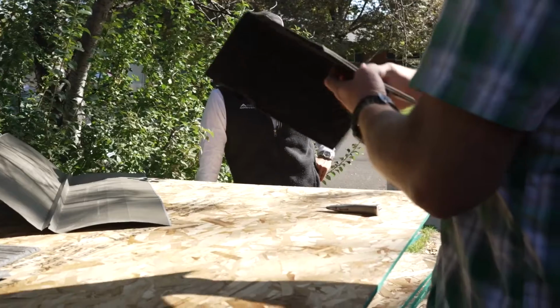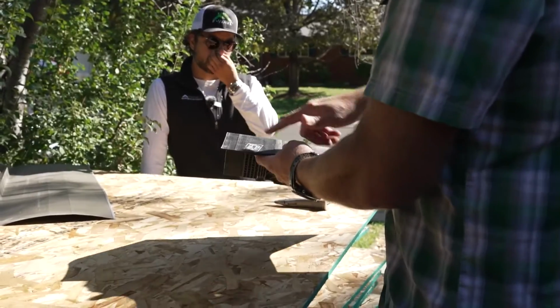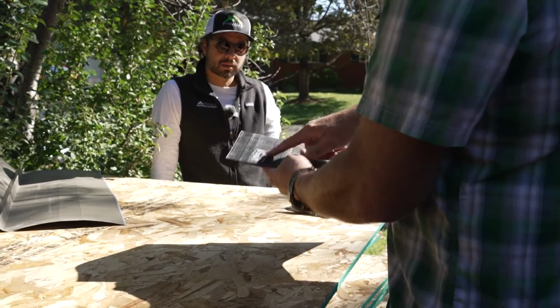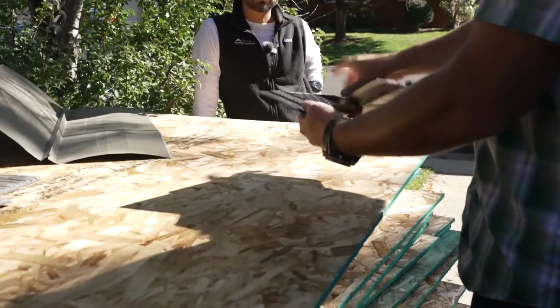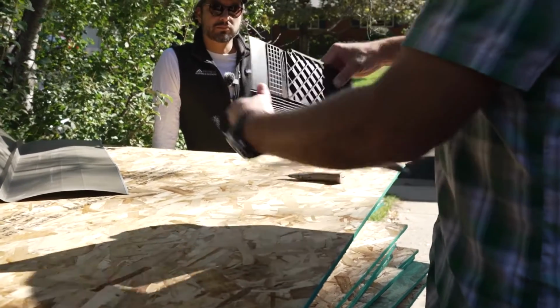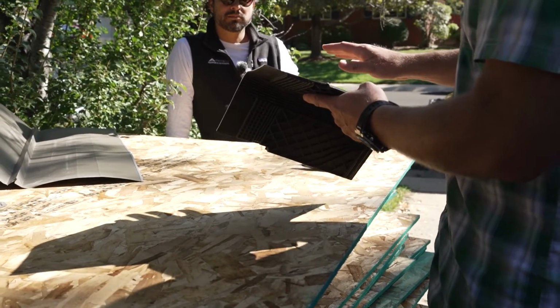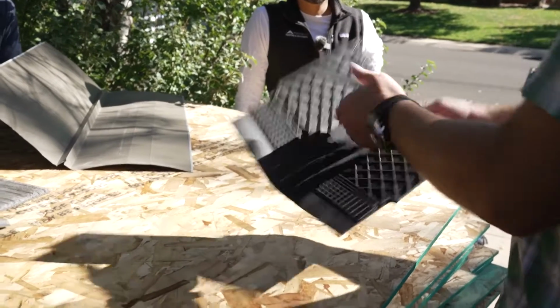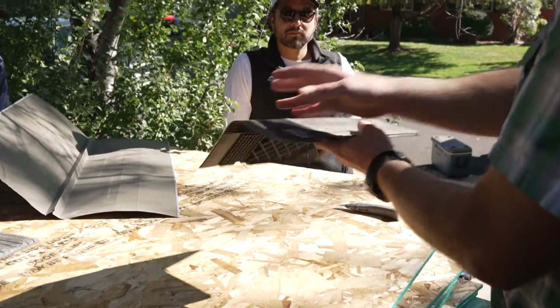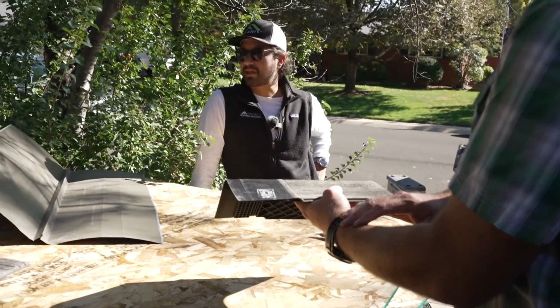Okay. So our ridge, very similar to asphalt, with a couple exceptions. One is our nail line is up here. Okay, so where it says nail here, clavo aquí, right? That's where the reinforcement is. So a lot of guys coming from asphalt, they want to nail it here. That's no good. Okay, no bueno. It's not reinforced there, and that's also where the glue for the next piece is supposed to sit in contact. Hay que tener mucho cuidado en donde lo clavan ahí.